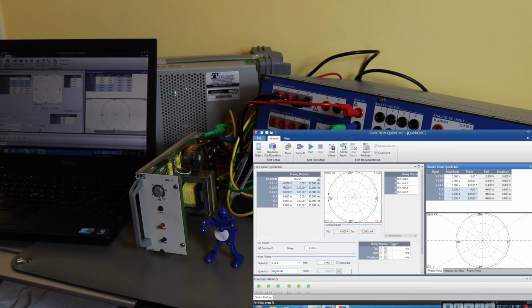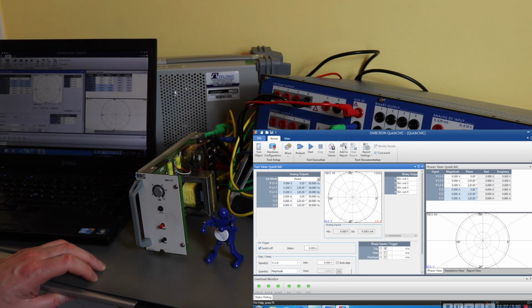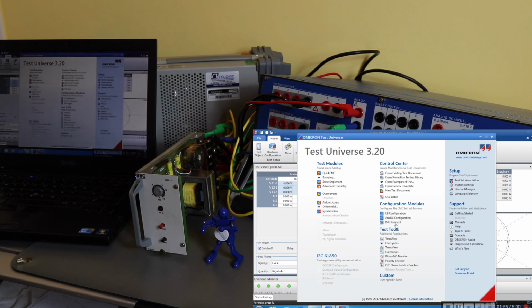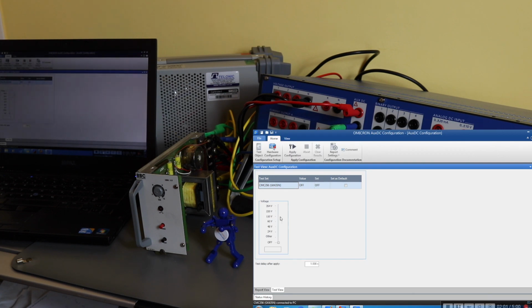Okay, so set up VLE1, I've set it to 5%. The actual tripping voltage of the relay is set by a solderable link in here, which is set to 100 volts, so that should pick up at 5 volts. So we'll go a little bit below that to start with, and I will look to pick up the start function. Okay. That's wise, the test set hasn't come on.